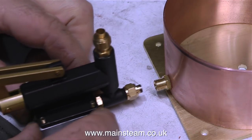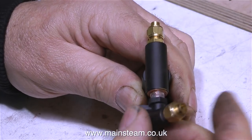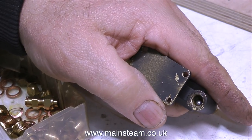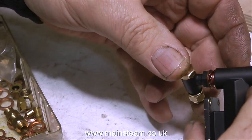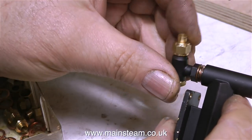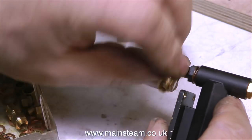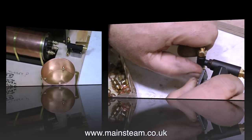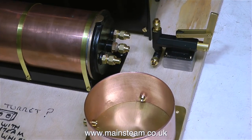This bottom water tank outlet is going to be connected to the water pump's inlet using a short piece of pipe. Unfortunately the right angle fitting is in the wrong position, but this was an easy fix. I just used a couple of shim washers of the correct thickness and re-tightened the fitting, and now it's where I want it — at 90 degrees to the vertical part of the pump body and also at 90 degrees to the horizontal part. This allows me to mount the water pump on the baseboard in a sensible place where I won't burn my hand when I'm pumping water into the boiler.